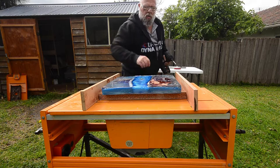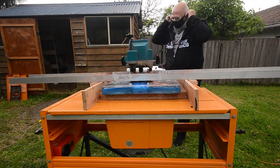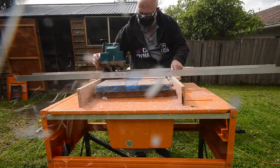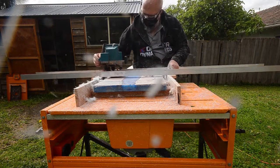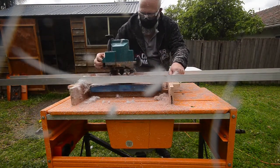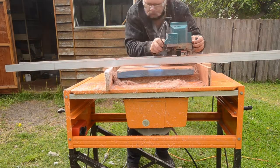Here we are outside — I'm putting the tabletop down into the router sled. The router sled is made out of a couple of lengths of aluminum angle, which keeps it all nice and rigid and straight. I'm using a 50mm planing bit in the router and that makes short work of this — it flattens it out in no time. It does leave little lines in the timber about a quarter of a millimeter deep, but they come out pretty easily. I planed down both sides to make it nice and even and flat.